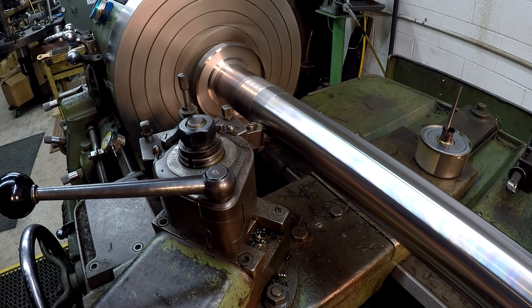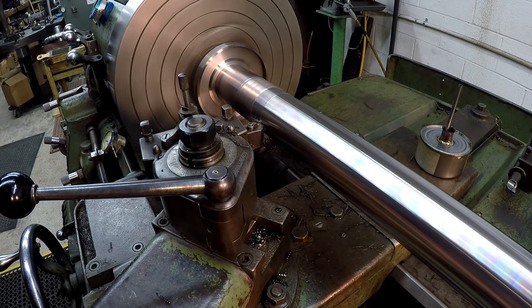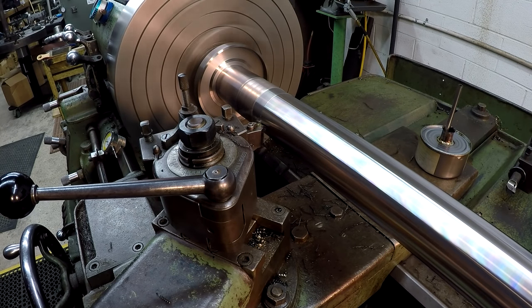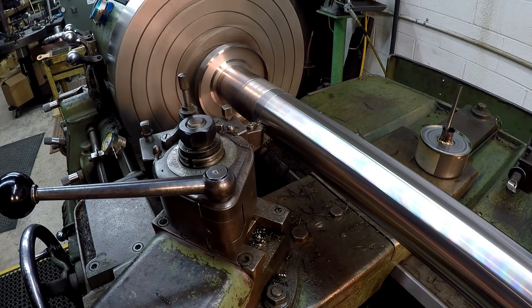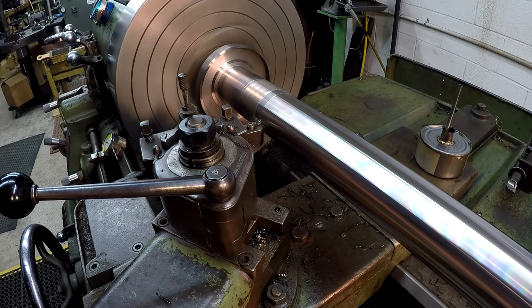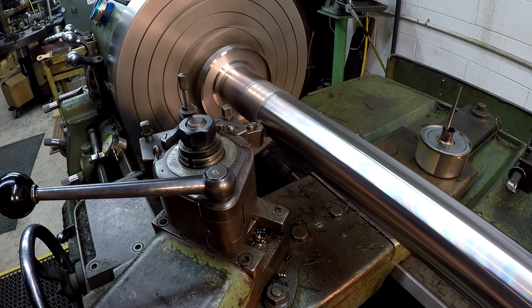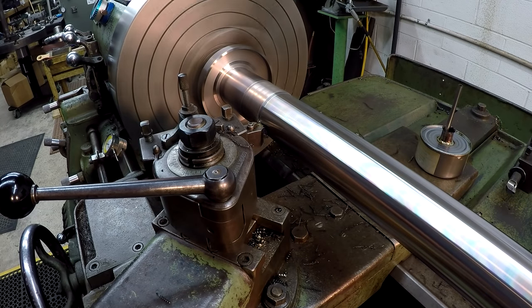Approaching our stop up here, and I was going to point out, you can see I've got my tool kicked at a little bit of an angle. That's actually one notch on the multi-fix, 9 degrees. I don't have to come up to a square shoulder, and it gives a little bit more clearance so chips don't try to get in behind that insert and start rubbing the finish.